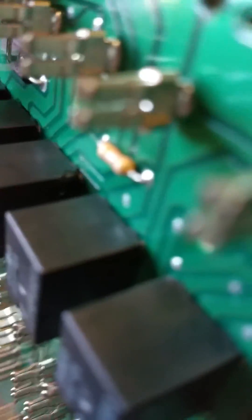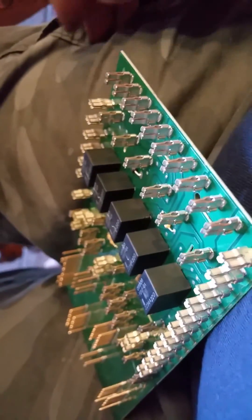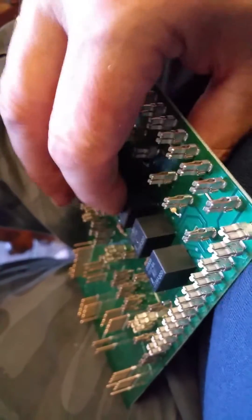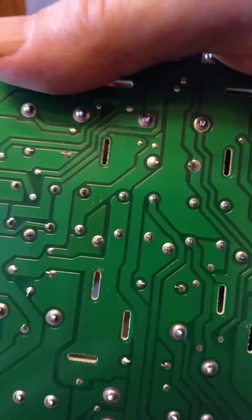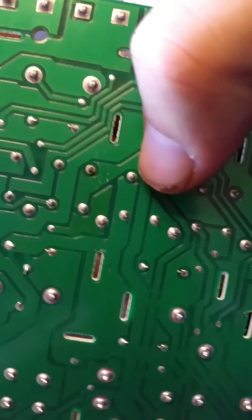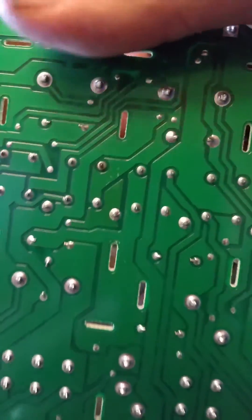Let me get a better angle and zoom in a bit. Sorry for the seasickness. But there, you can see the corner of the plastic is all melted. That part is in the mailbox tomorrow. It's a simple job to change it out — de-solder five of those legs; any ham should be able to do that. De-solder five legs, put the new part in, and reassemble the board.